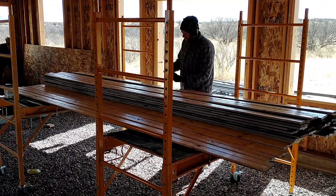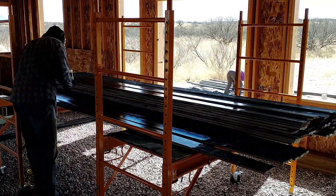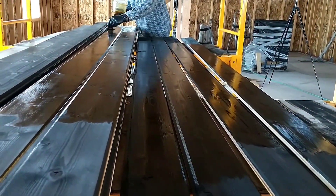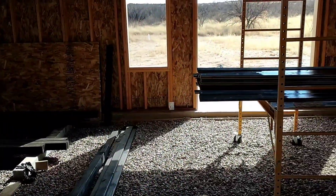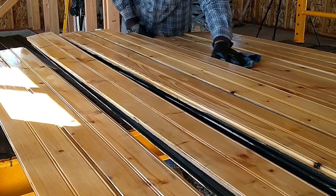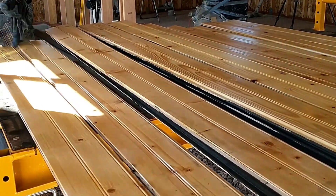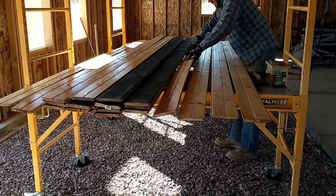Now we're moving on to actually sealing all the wood. Everything's blackened, and now we're sealing it on both sides. The sealer we're using is something I've used before and have a lot of confidence in — I had to special order it, but it's called Penofin. This is the Penofin Red Label, which is kind of the best stuff they sell. It's a high-quality, oil-based penetrating sealer with really good UV resistance. To apply it, you put on a thick coat — either brush or wipe it on — let it sit 15 to 20 minutes to soak in, then come back with a dry cloth and wipe off the excess. It's really important to wipe off the excess, or it'll dry into a sticky mess. If you do wipe it off, it leaves a nice eggshell-type sheen.